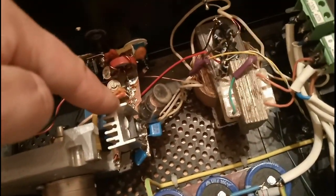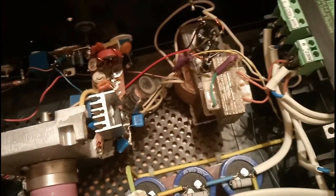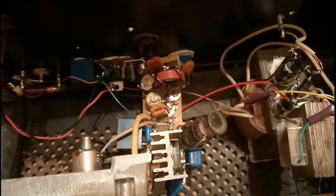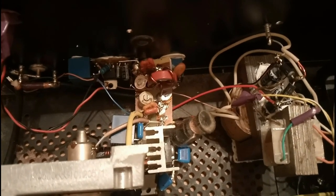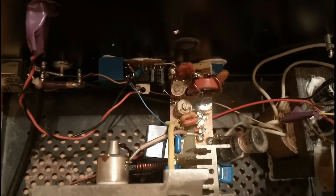We have the bias transistor — I'm using a simulated Zener power diode using a PNP Darlington transistor. The input circuit is a monoband for CB; it's a Pi-filter at the input to ensure no SWR, so the amplifier is perfectly matched with the transceiver using this Pi-filter and antenna tuner.